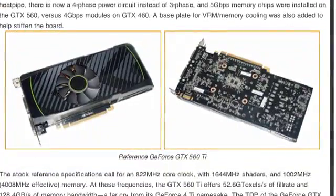Marco, you are talking about graphics cards next up. Huge surprise — what are we talking about today? So we've got some good stuff, launched Tuesday morning. This is the NVIDIA GeForce GTX 560 Ti. NVIDIA has resurrected the titanium moniker. It's a relatively affordable graphics card, going to be priced anywhere between $249 and $269 depending on the clock speeds, and it turned in some excellent benchmark scores. The GPU on the card is codenamed GF114, and it's really just a re-spin of the GF104 that was on the GTX 460. But this new revision hits higher clocks, all of its shader cores are enabled, and it decimates the GTX 460.